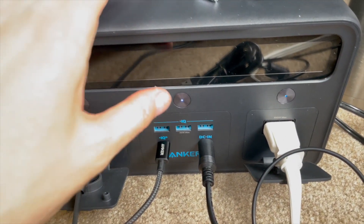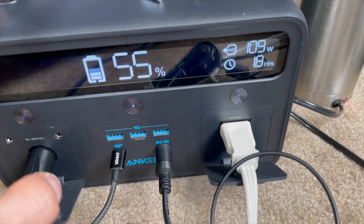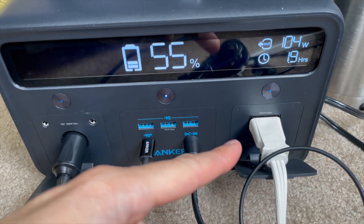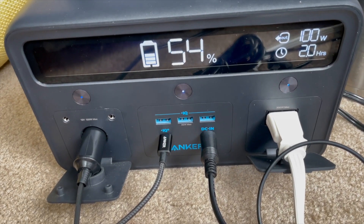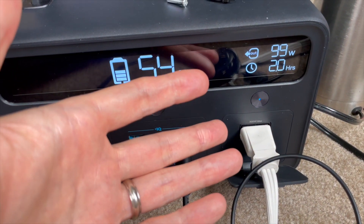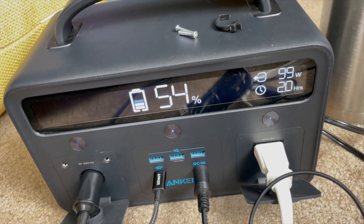It's been a trusty companion for two years. My only gripe is that this inverter is 300 watts maximum. It has the electronic cutout. But if you accidentally plug in an inductive or capacitive load and try turning it on, fuses are all about the amount of current passing through them. So when it turns on with a massively out-of-phase load — power factor of 0.3 or 0.4 — it might be 300 watts but it's like 900 to 1000 VA.